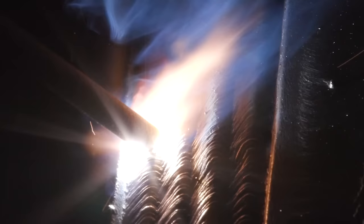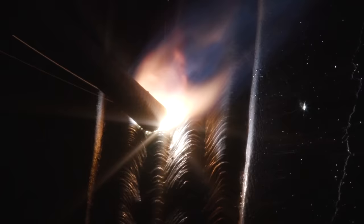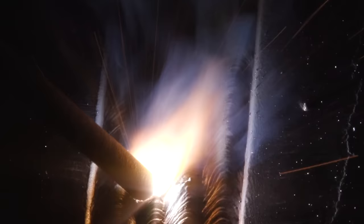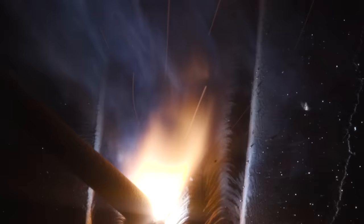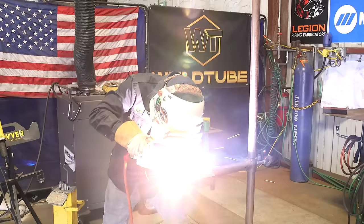And your cap might start looking like this. A little bit uneven, but it doesn't mean you can't do it. You can actually cap it slightly under flush or perfectly flush. Now remember how I said before that if they let you grind, then go ahead and grind any imperfections that you have. This is how you're learning, right? This is how you learn, and so on.